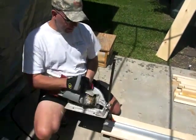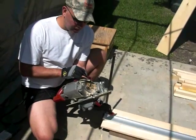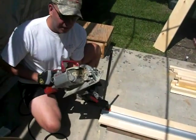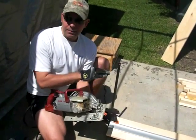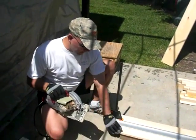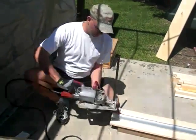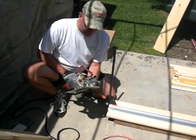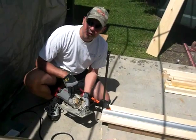What you also need to know is your distance from the blade. In this case I'm making a cut with my fence on the left. In the builder manuals for the flight sim stations it goes into great detail about cutting wood from two sides of the material, whether you're cutting this way or coming back and cutting the opposite direction, and also how that relates to which side of the line you want to cut on — whether your scrap material is on your left or right. That distance for me from the fence line to my blade while set at a 45 degree angle comes out to two and five eighths inches.